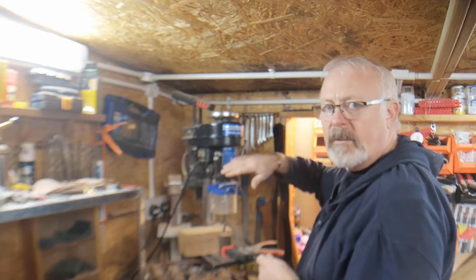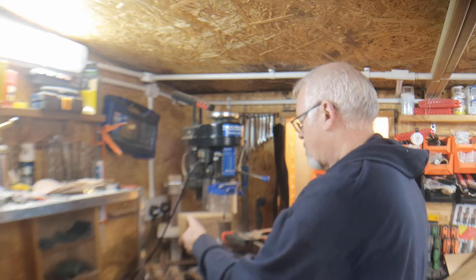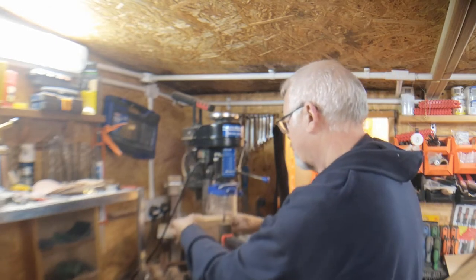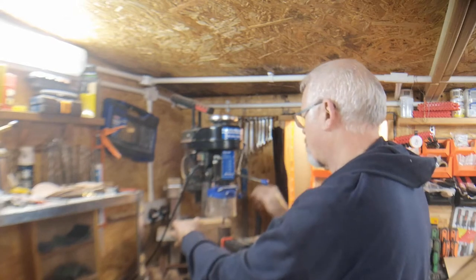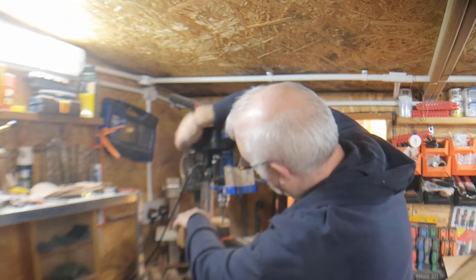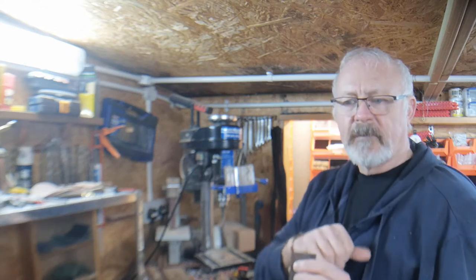Now you will notice, obviously I've only got a small bench drill, so you notice that I've not got enough travel on it to get all the way through. So again, using a very sophisticated couple of pieces of pallet, all right, it just allows me then to get more travel. Right, and then just take it off. So there we are. Got plenty of, probably too much there, but it's better too much than too little.